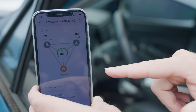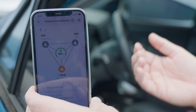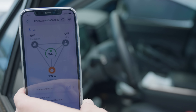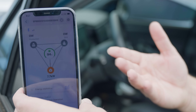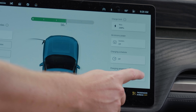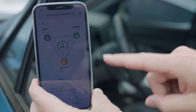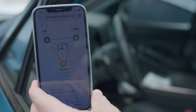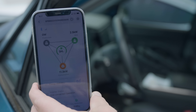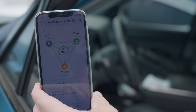You can see it hit the amount of energy being pulled while charging. Most EVs — the Rivian, the Tesla — can pull 11 kilowatts, which is more than the battery can put out. But if you just pull down the amps a little bit, you can modulate it and keep it within range, meaning you can charge off-grid. If you amp it back up, it starts to pull additional energy from the grid once it exceeds what the battery can output. You can have multiple inverters to go entirely off-grid, but with an affordable system meant for peak shaving and backup power, you can still be totally flexible whether you're charging an EV or just running your house.